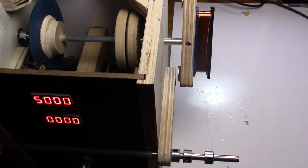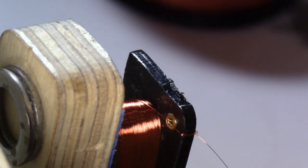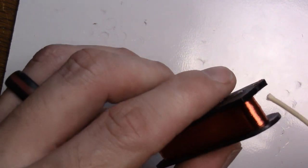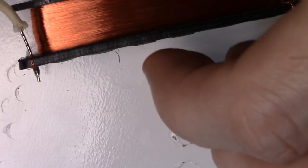And 5,000 — there's our 5,000 windings. I'm going to cut the wire down here with my scissors. There's our finish winding. Now I'm going to pull the pickup off so you can see we've got our finish winding there and our start winding there. You can tell the start goes right into the center of the coil, and the finish comes right off the outside. So we're going to do: white is the start and black is the finish.